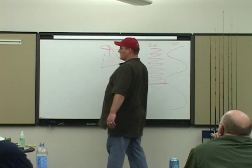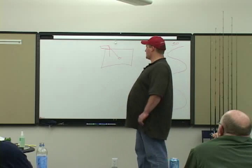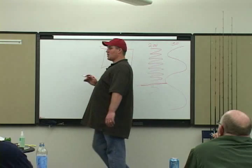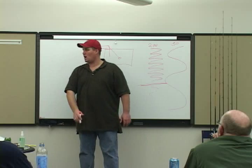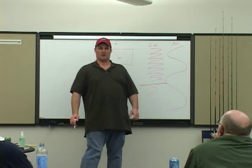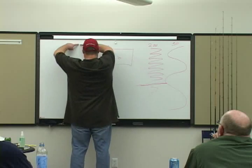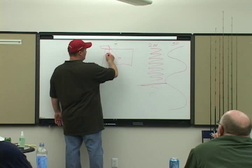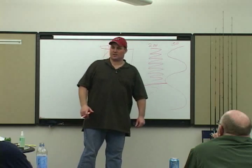Take your transducer. I don't care if you're trolling down 40 feet — take your transducer and switch it over to 50kHz. Now, 50 does not draw a nice beautiful picture because it's wider and takes longer to draw, but it still shows you what's down there. By putting it on 50, it widens the cone — remember the cone was 36 degrees? Now it spreads out.